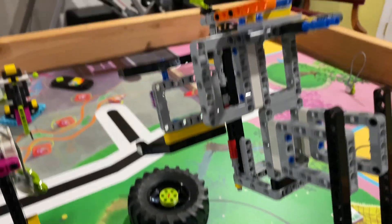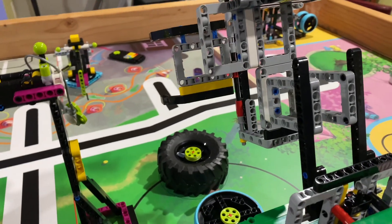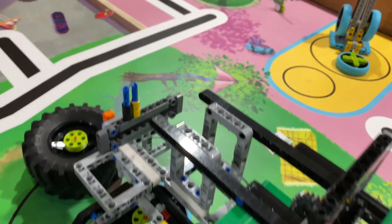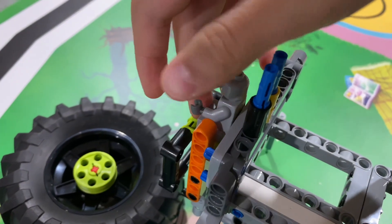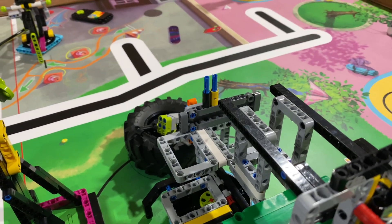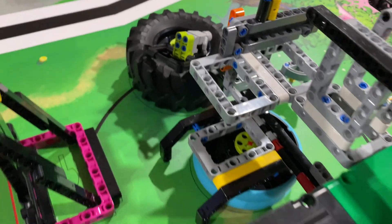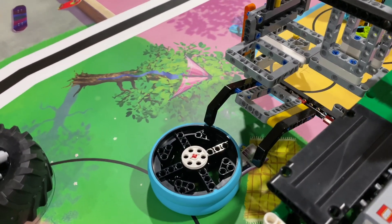To flip the tire, we have a mechanism like this. It is a lever with an arm around it, which can be rotated by this one gear right here. This can also rotate, and this is used to solve the rowing machine. But for the tire flip, when the lever is placed down in this position, the slide figure — which is also loaded on a lever — is placed back here. I have this half beam here to introduce some slope, so the slide figure falls down when it's in this position. However, when it's up, the slide figure is facing down so it won't fall. But once it's in this position and it's over the wheel with the slide figure on, just by the robot simply moving forward, it flips the tire — which is a pretty cool mechanism.